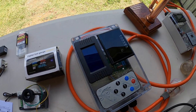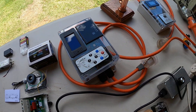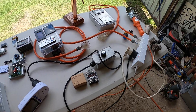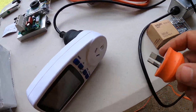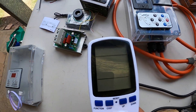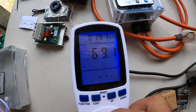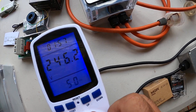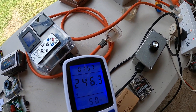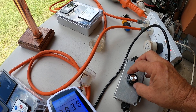I've got a test lamp to see how many watts and volts it's putting out. I'll just plug it in for you — it's turned off at the moment. Turning the power back on, you can see the voltage is 246.3 volts on the SCR controller I've built. Now when I turn the knob to about halfway, you can see the light is dimming as well.